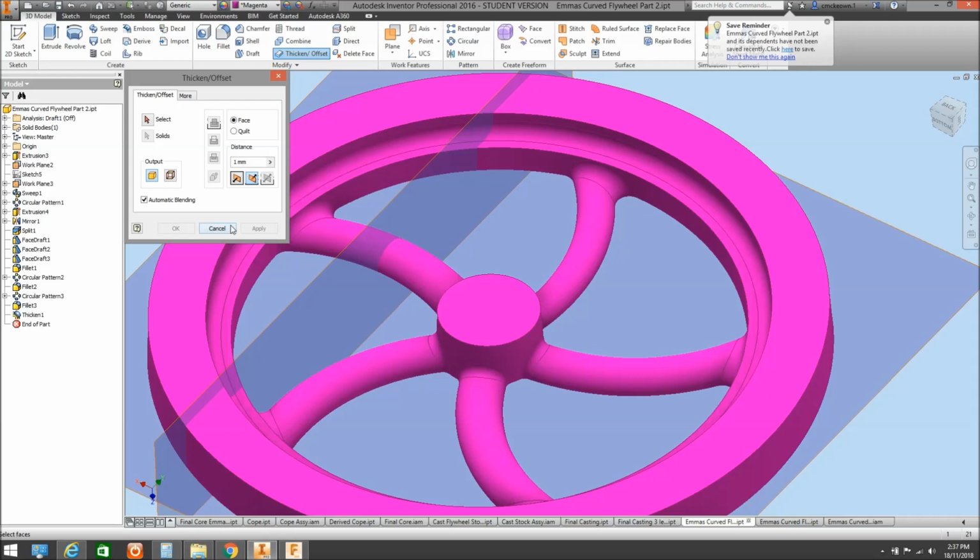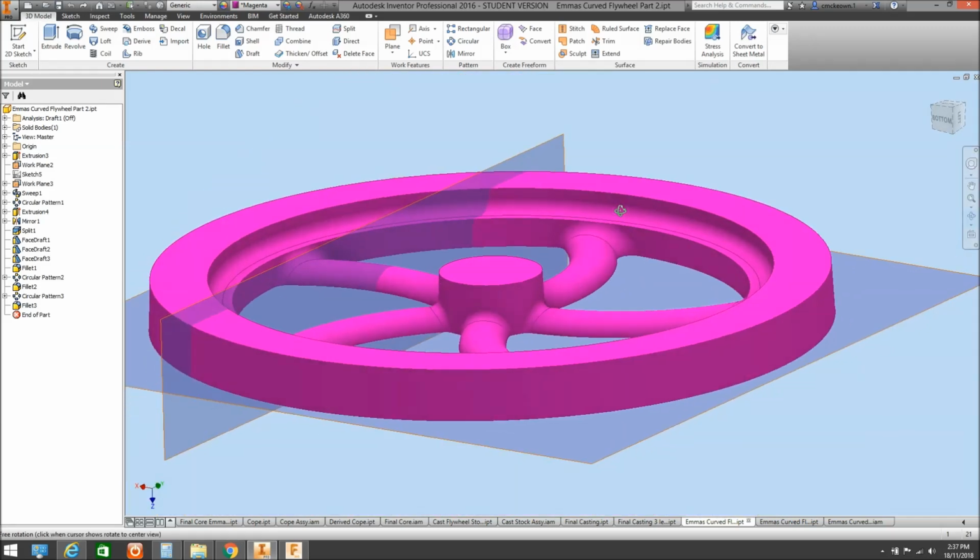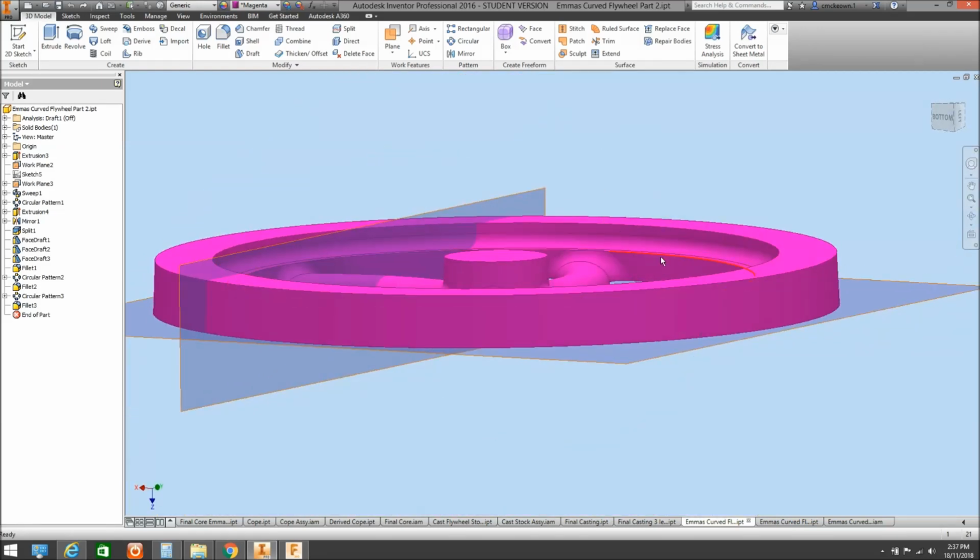So if you think you're going to build it up by 0.2 millimeters, you can allow that. Particularly with core boxes, the cores will actually tend to shrink or be smaller if you do put a high build spray putty on there. So you can build that into your model. So we won't do it in this particular case.